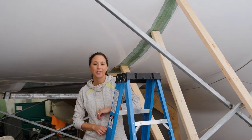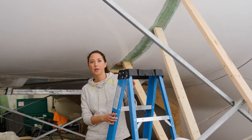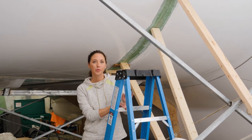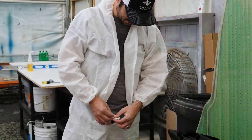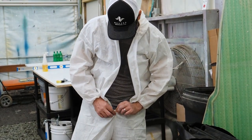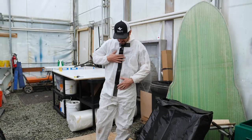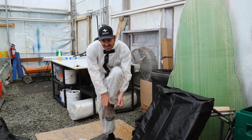We're back today to continue working on the upturn area of the bridge deck. We've given it a full 24 hours to let the vinyl ester set inside the cracks, and just like we hoped, it has seeped out both edges, so we know it's completely full. Matt's job is now to go back, grind it down smooth, and then we'll start glassing while we have a nice sunny day with low humidity. The zippers on his Tyvek suit are completely gone — it's truly one-time use now. Nothing a little gorilla tape can't fix — it's like a reverse race stripe, a negative of a skunk.